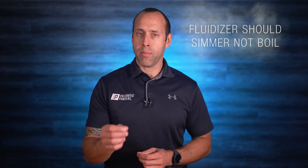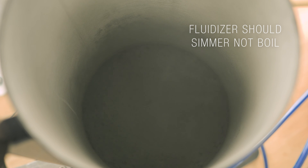Low fluidizer air pressure: if you use a fluidizer, it could be that your fluidizing air is too high or even too low. In either case, you're going to have an inconsistent feed of compacted powder transferred through the pickup tube, to the hose, to the gun, and onto your parts. When setting your fluidizing air pressure, look at how the powder is behaving in the fluidizer — it needs to percolate, but you want a simmer, not a boil. Powders that are denser may require more air, so look at the behavior of the powder in the fluidizer to know where to set it.